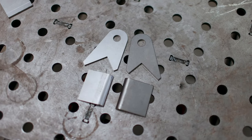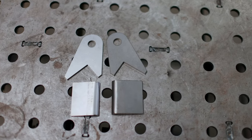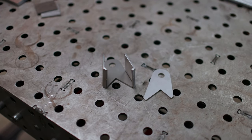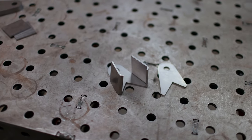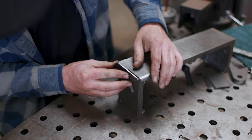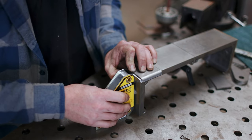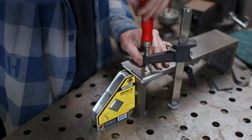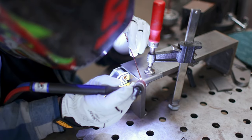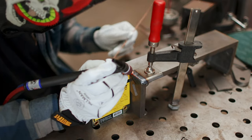First on the list are the front upper control arm mounts, the simplest parts of the entire project. These two small folded-over pieces wrap around the ends, and the entire thing gets boxed in — it's a great place to start and get our feet wet. A common theme for all of the parts we're building in this episode is a lot of fixturing and jigging. I need to make sure all of these parts are true, square, and properly spaced. I'm also TIG-welding this entire project because the only way to get better is lots and lots of practice.